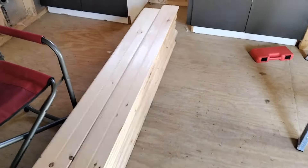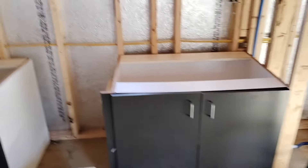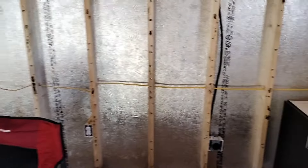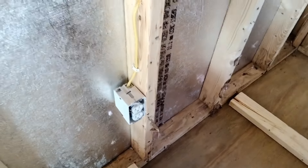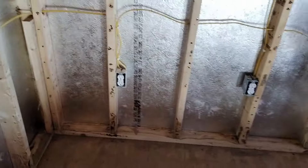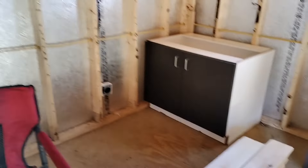I'm not going to do this back wall until I get my sink where I want it and the plumbing figured out - I'm not covering that wall until all that's done. We'll probably do this wall and insulate it, and this wall and insulate it, and get these two buttoned up since all that's in there is electrical. I'm going to have to bump my electrical boxes out because they're set flush with the studs. Adding three-quarter inch of tongue and groove will recess them, so I'll need to bump them all out three-quarters of an inch so they'll sit flush.